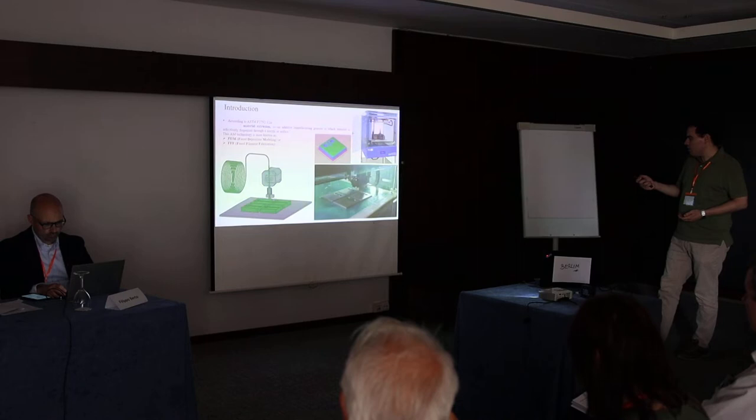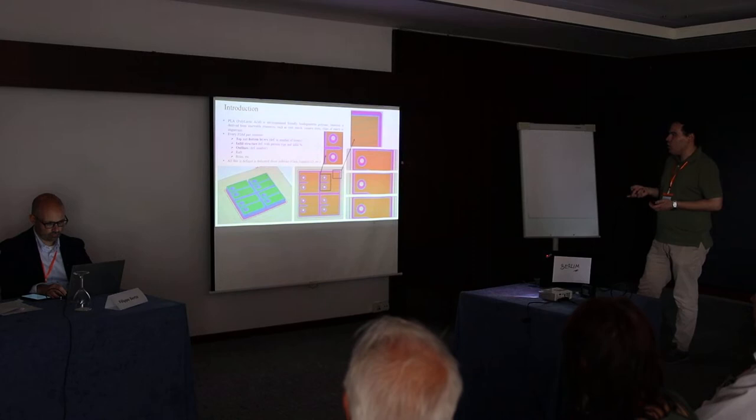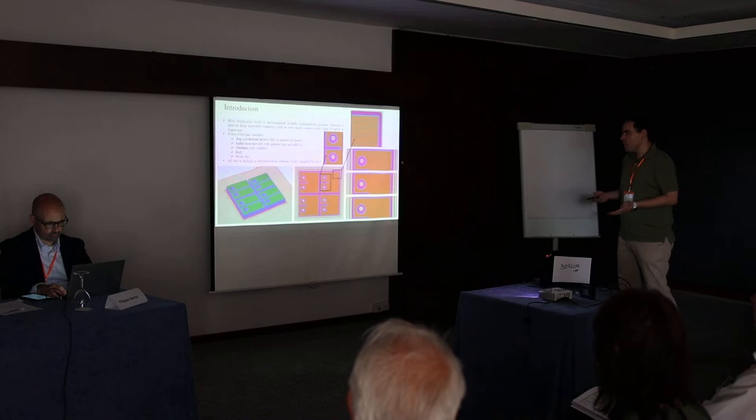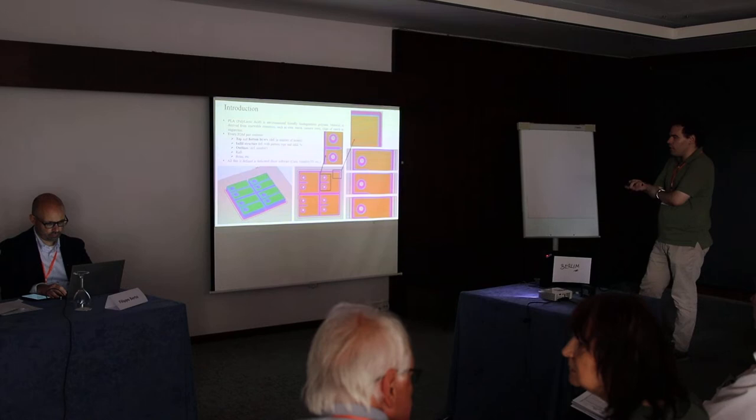Next, just to point out a few features in the slicer software, where we prepare our specimens: all of the FDM specimens have top and bottom layers, which are different from the infill structure, which has different patterns or infill percentages. And around this infill structure, you have the outlines. We use the honeycomb infill structure, and all of our specimens are full density, so 100%.